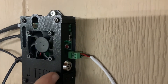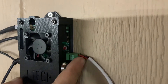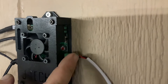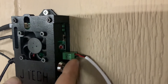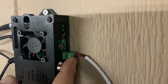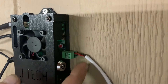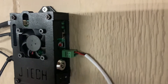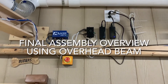The last component in the wiring is installing your e-stop. The end of your e-stop is a raw wire that goes in the front of the J Tech laser controller. The black wire goes towards the switch and key, and the red wire goes towards the reset button. To make this easier, unplug that part from the unit, put your wires in, then plug it back in. Then mount your e-stop switch wherever you want.